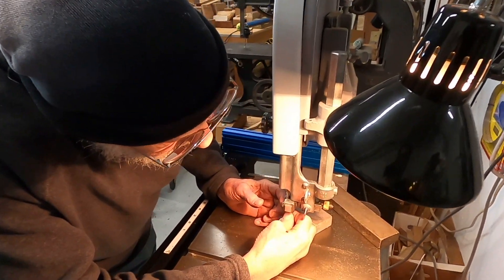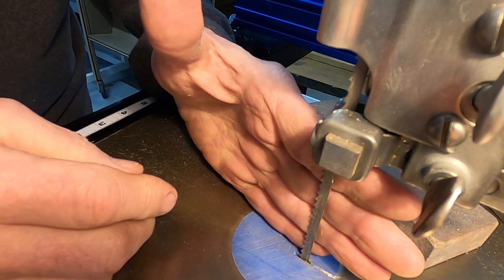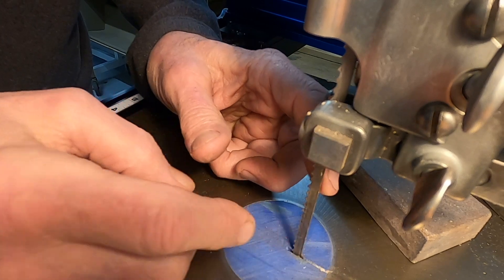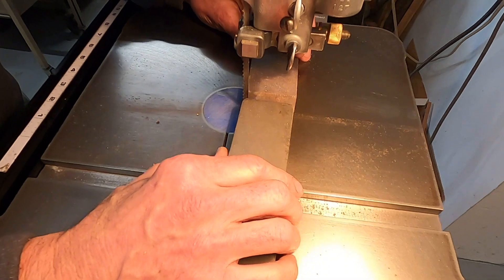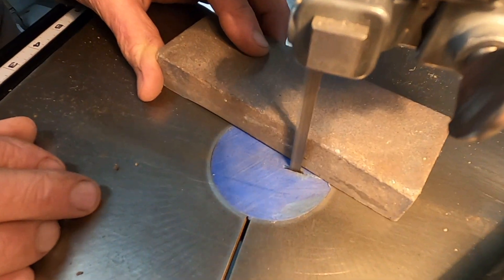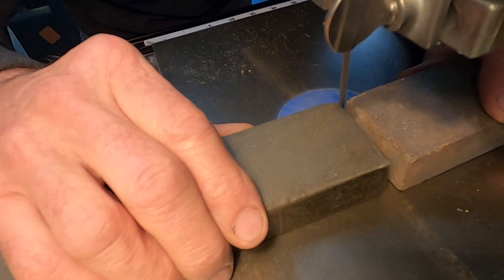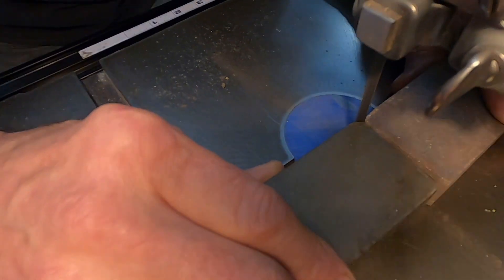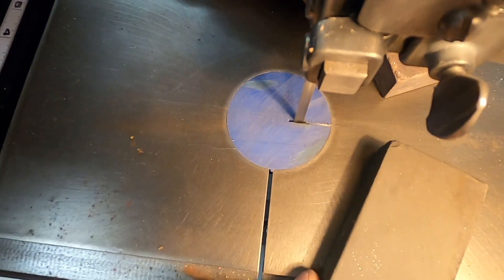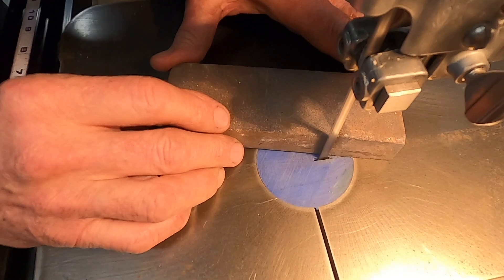Okay, we'll take a look here and see how it feels, making sure we don't have a burr. There's maybe a little burr on this side of the blade, so I'm going to go back at that to clean it up. This side feels good. Next, we're going to take two of these stones and just touch like this — I'll do both of those things right now. And finally, we're looking for those wild teeth.